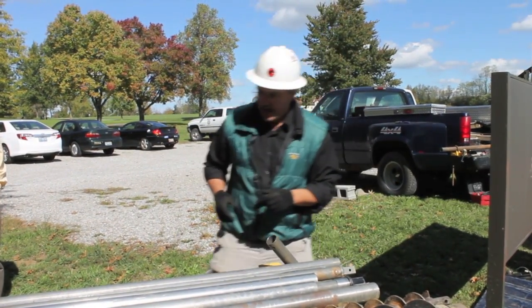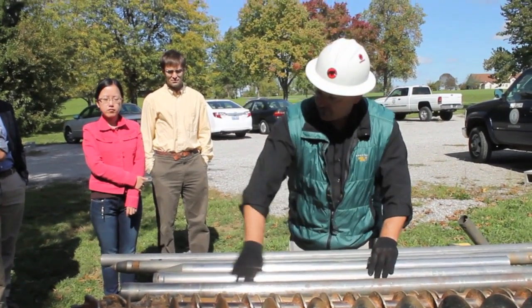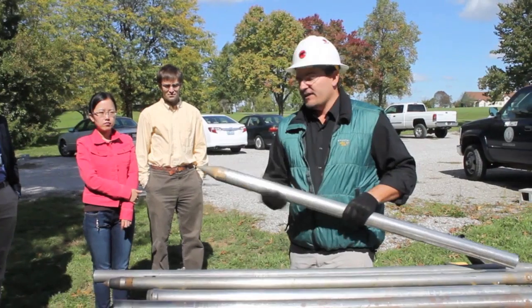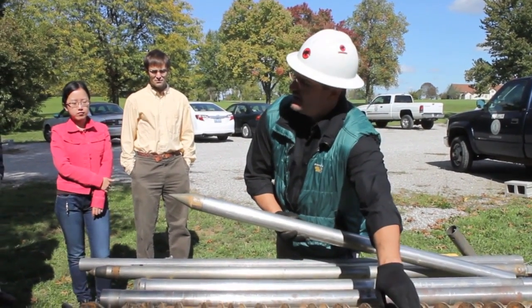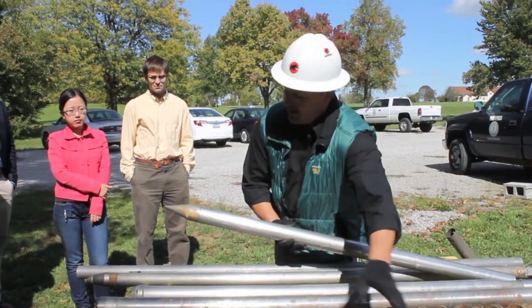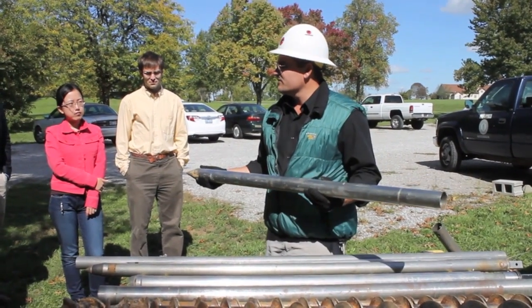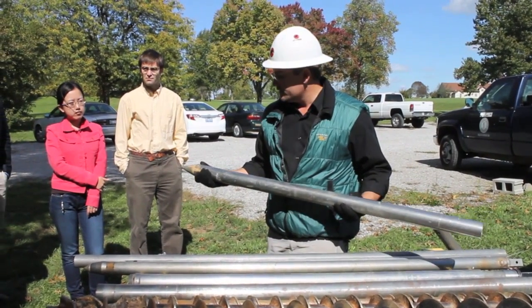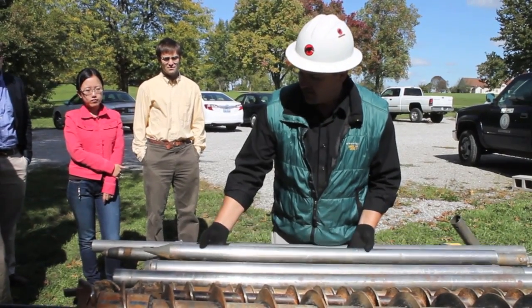I had this custom made on the end to keep the borehole open a little bit larger, so you don't get all the friction and you can go deeper. And then I had this pit point made. We can auger with these to get cuttings, and then if we want a gamma log instead of shooting these heavy things, we can just drive this straight into the ground. We only have nine meters, and then we can gamma log through the steel — it pulls up really easy. I only bought nine meters because I wasn't sure if the rig could push it, but it's doing it just fine at nine meters, no problem.